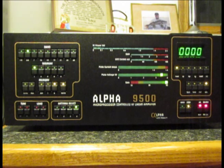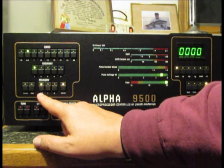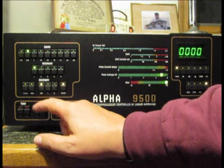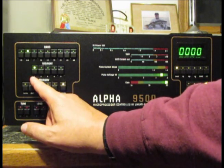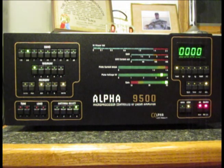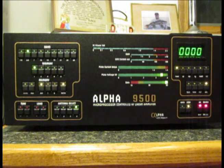I have a tuner on my vertical antenna, providing the linear with a one-to-one match, as I would in a practical application. I've set it on the defined factory settings, and since my tuner offers a close to 50-ohm resistive load, it should be fairly close already. Notice it already switched — as soon as I tuned the exciter, it switched down to segment one from segment five. I'm going to hit the exciter and increase the level of excitation, bringing it up to about 1,400 watts.